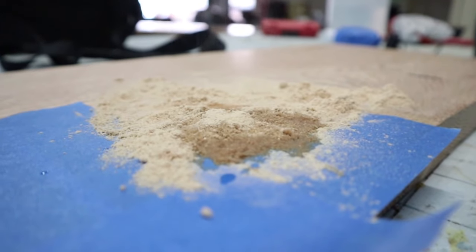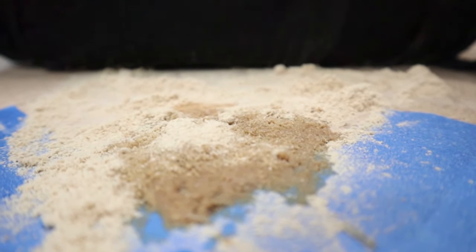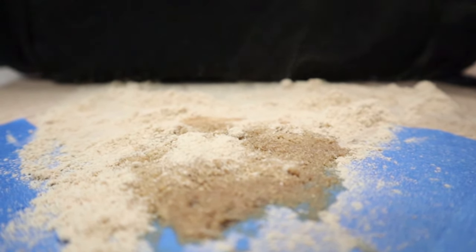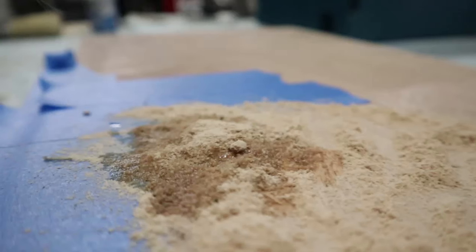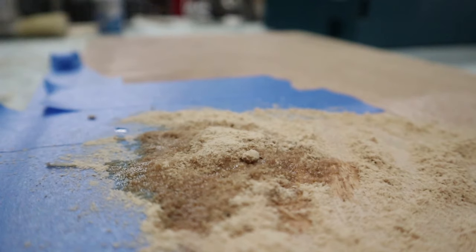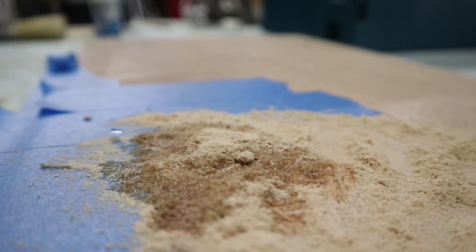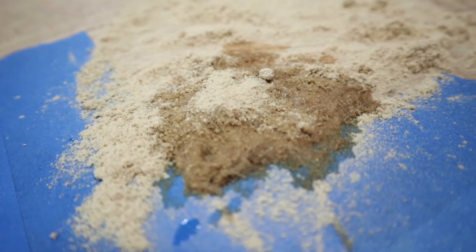You can see it's actually starting to smoke. This is what happens when cyanoacrylates mix with fibrous materials like sawdust — it starts to polymerize instantaneously. It is an exothermic reaction, a lot like certain types of epoxies or Bondo. It heats up incredibly quickly. You've got to be careful with this because on a job site, if you're not paying attention, this is how shop fires start. Right here you can actually see the glue boiling with the wood — it's become so hot.